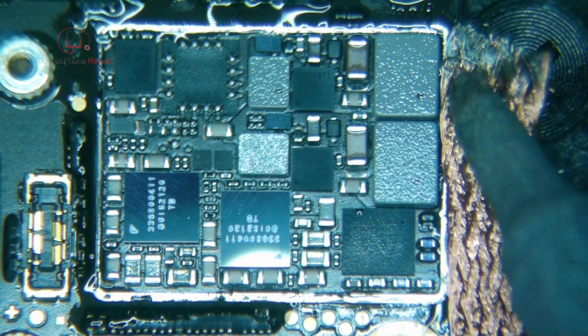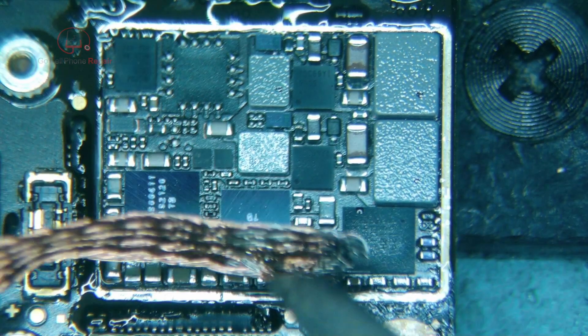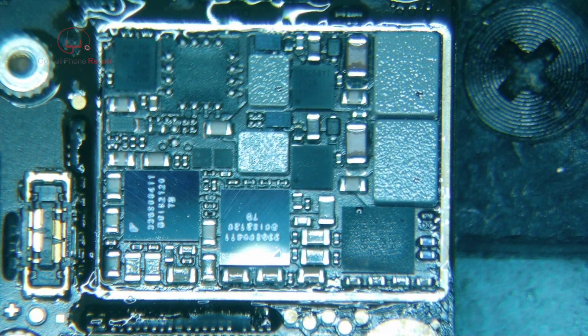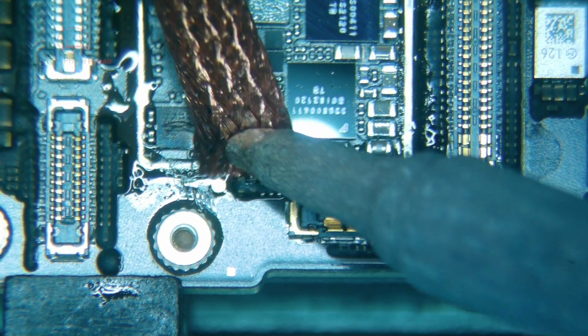Like I said, we don't want to leave the low melt alloy behind. It's relatively easy to get this stuff off, so you don't have to stay here so long that you're causing problems for surrounding components. You can even hold this with the tweezers if you have them. But as long as you heat the wick, it's really going to draw this stuff out pretty easily. We'll come back and deal with the shield after we figure out why we have no backlight.